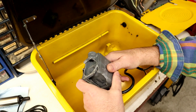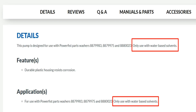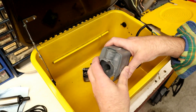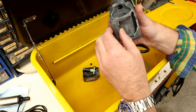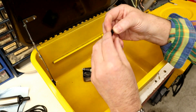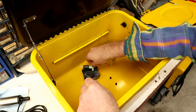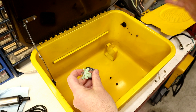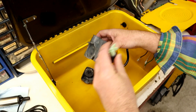Here's the important caveat you should know about: all these new pumps and even most of the new 3.5 gallon washers are specifically saying now that you have to use a water-based degreaser — you can't use a solvent based one. I've always used Varsol or kerosene. The pump looked identical but the plastic just turned to mush, and the little impeller bushings made of rubber were basically gum when I took them out. My old pump failed on the impeller itself. The tip: if your old solvent-safe pump's impeller is shot, just swap in the impeller from a new pump into your old housing and you'd probably be fine.